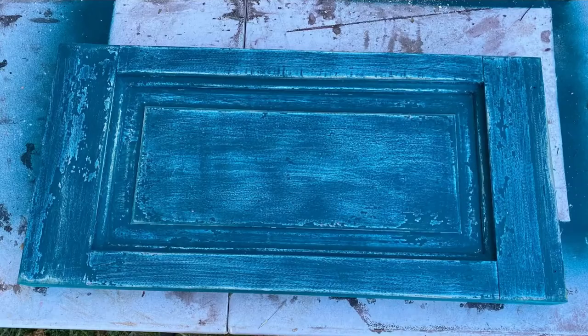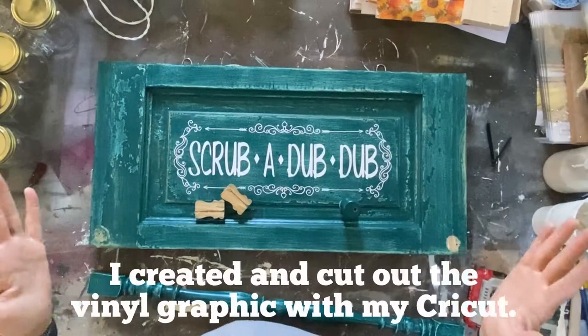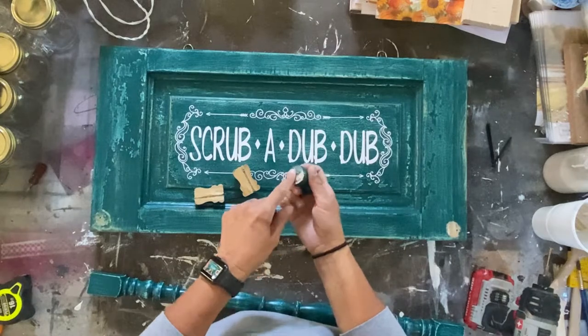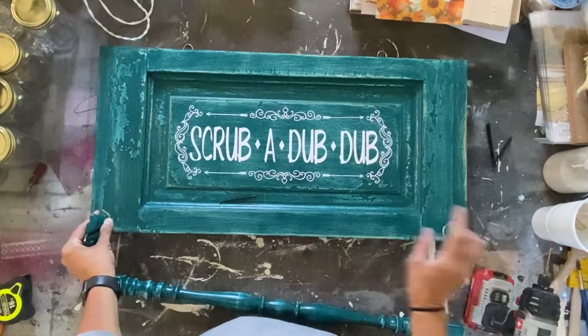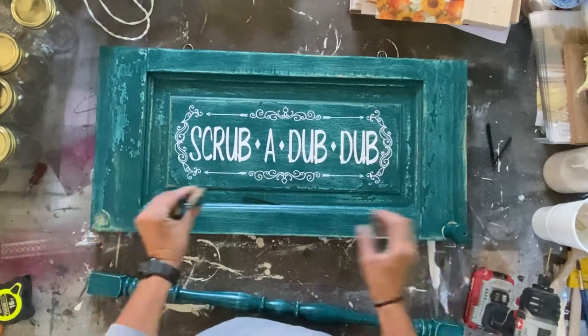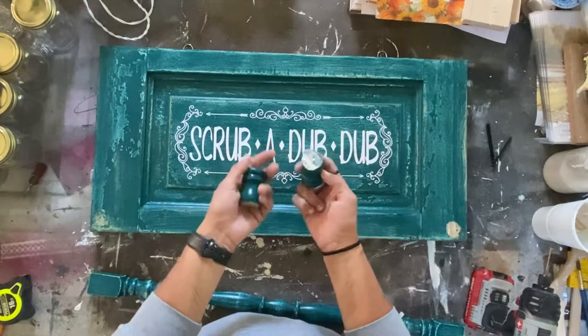This is the back of the project after I sprayed and distressed it with sandpaper. I also sprayed the spindle and the two little end pieces and distressed those as well. The shelf piece on top is just a two-by-six. I put construction adhesive on the end pieces after painting and connected them to the back, but when I went to screw them in, one side split and both pieces just popped off — the construction adhesive did not hold.